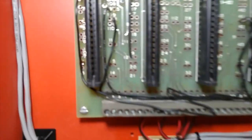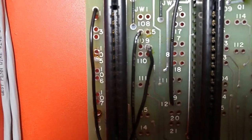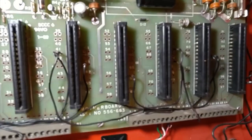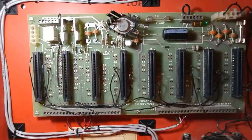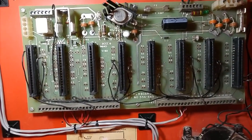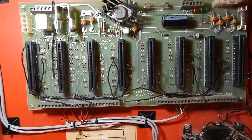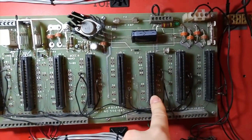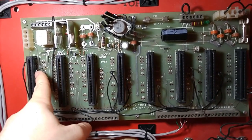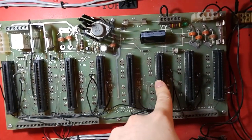Now you will notice there are numbered holes with jumper wires going between them, like right there, right there. All these jumper wires go to the different card slots, and they all have different functions. Basically how the 2001 works is that you have jumper wires that connect each card to different things. On a simple 2001 system, you would have some jumpers which go from the NAC card, which would go in this slot right here on my panel, to the system control card's 24 volt output when the panel is in alarm, and that's what sets off the NAC card.